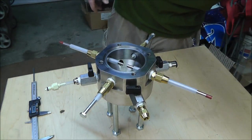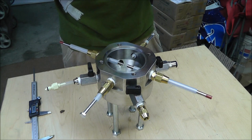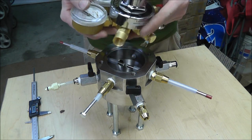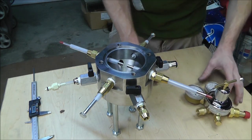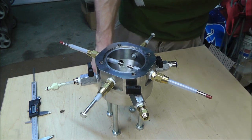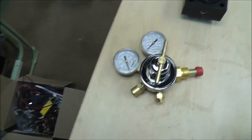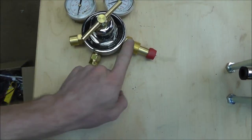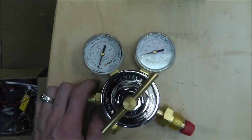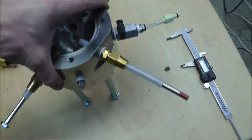Lastly, I did want to show the gauge. I have to thank the person who purchased the camera, the hydrogen cylinders, and the argon. We were going to get a few other different gases, but I didn't get those yet — I wanted to do a few tests first. This gauge is probably a 250 gauge. It's not a two-stage gauge, it's not really designed for pure gases, but it fits the same size and it works. I'll probably put a second regulator on it to make it double-stage, because this will only go down to 5 PSI and that's not really low enough.